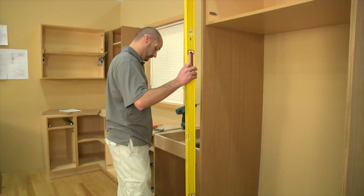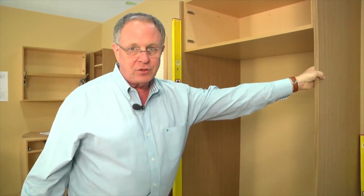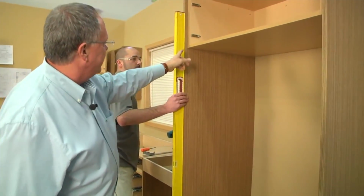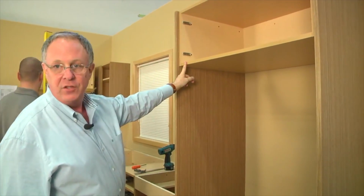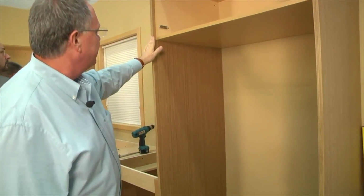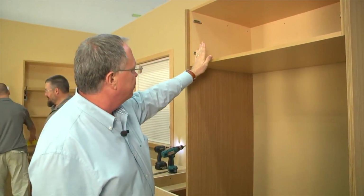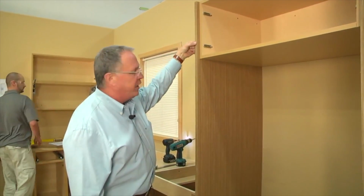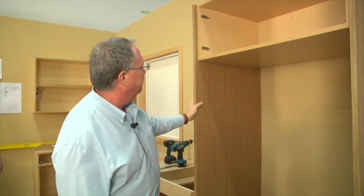They've moved the assembly, the wall full depth cabinet attached to the applied panels. You'll notice too that the applied panels are extended beyond the face edge of the cabinet box. The reason for this is you want to have the door plane, when they're installed, to be flush with the edge of this panel. You'll see more of this in our next segment.